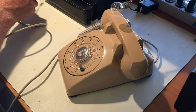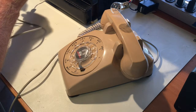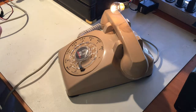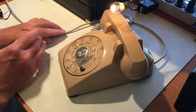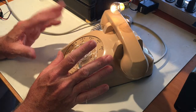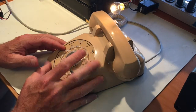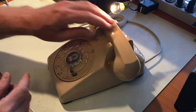We'll connect power and connect our lock. I've got two things going on: a little cabinet with a spring-loaded drawer — there's a spring trying to push the door open and one of these mag locks holding it shut. As long as power is applied, this thing's going to remain shut. I also have a light bulb connected in parallel to demonstrate when the lock is energized and when it's not. When you receive the prop, the first thing you'll want to do is open it up to access the setup menu, done with the button on the inside.